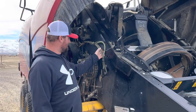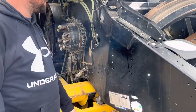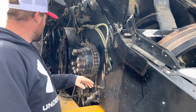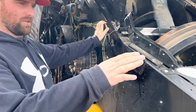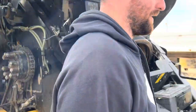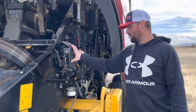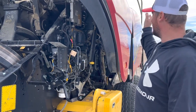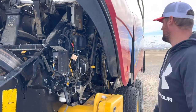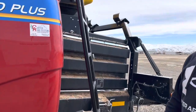If you come over here you can see the old style systems use three hoses and three pumps from the tank that come down and go to a spray bar. It's got the crop sense eyes and three hoses and a harness that goes to the tractor, and each pump sprays a different output. This is the old version — it's all ISOBUS — and it runs this controller off the side of the baler, with everything else going up to the tank or to the tractor.